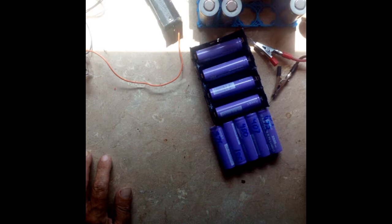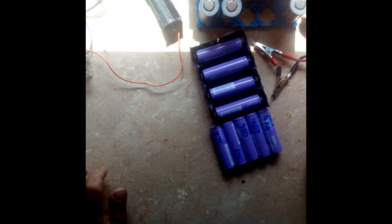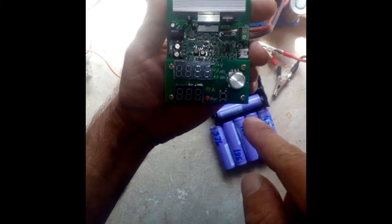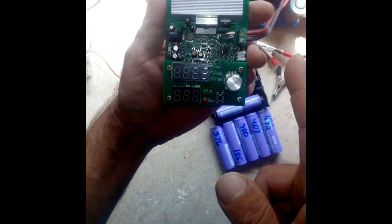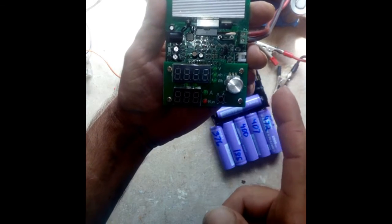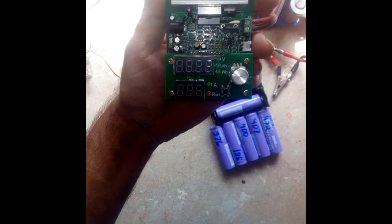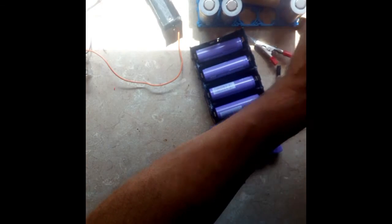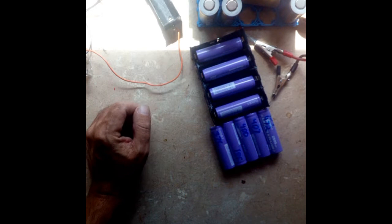The battery's absolute max current is 5 amp. I've already tested that with this digital current control — set at 5 amp, it went from full charge all the way down to 2.8 volts. I tried 6 amp and it gave a voltage error. So 6 amp you can pretty much forget it on these. If you run a constant 5 amp, I cannot guarantee they will not overheat and explode — they'll most likely handle 5 amp for a few seconds, but several minutes, no.